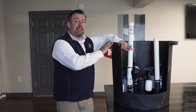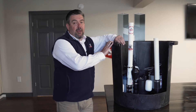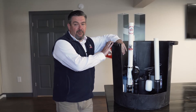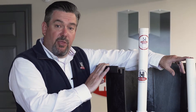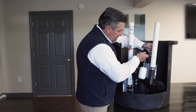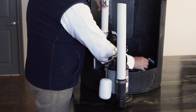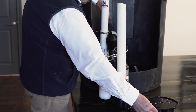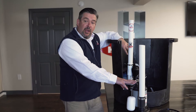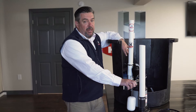Obviously this isn't something that's needed in every home, but if you want the maximum amount of value and protection that you can have, this is the pump system we recommend for you. The secondary one-third horsepower pump is set inside the pit on a small pedestal so that it is raised up just slightly higher than the main pump. This means it won't run as much, so you're only using this pump during those really heavy rain events when needed.